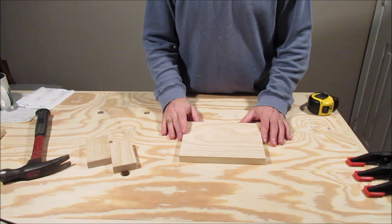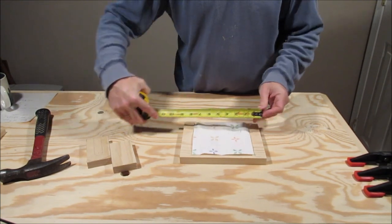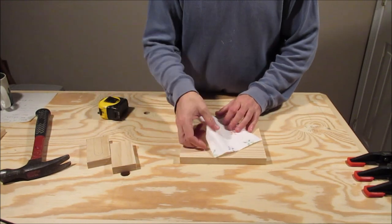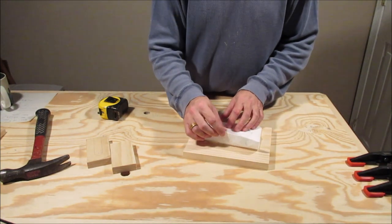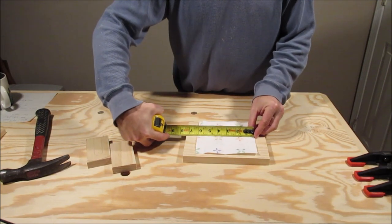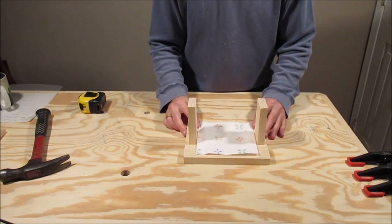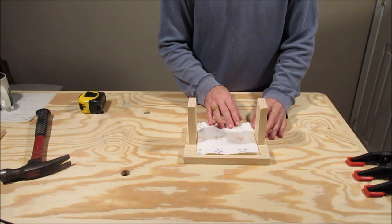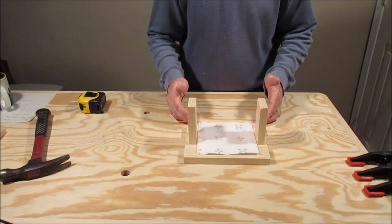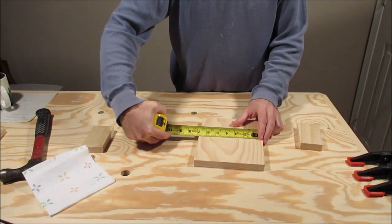To figure out the size, I just took a regular standard napkin. By the way, napkins aren't exactly square — it's about six by eight inches. I don't think it matters which way you orient it. The way I did it, the fold is on the outside when you pull it out, so the long side is in between the uprights. I left an eighth of an inch to either side of the napkin for wiggle room. The base plate ended up being eight and a half by six and three quarters.